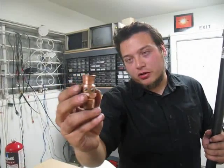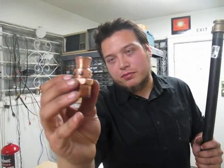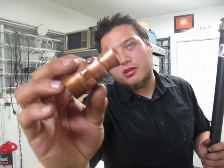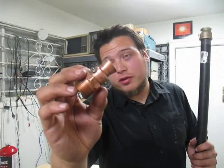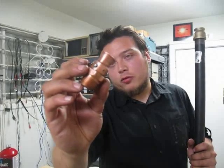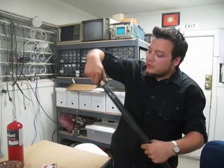Now I'm going to show you what real manufacturing is like. I'm missing one of the 6 screws. I'm not actually missing a fitting there, but that's a tap. I broke one of the 4-40 taps when I was doing it, and removing a tap that small is very, very difficult. You might as well dynamite the piece. But I figured that a tap would be as effective as a screw, so I just cut it off and ground it down, and there you go.